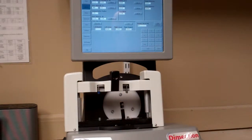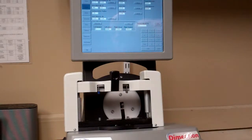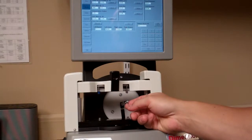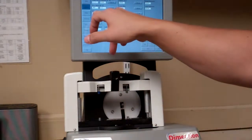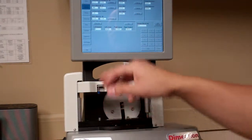The next item down is Extend Stylus Radius — you never change that number. It's set from the factory and is a measurement of the stylus. Unless a technician replaces the stylus and remeasures it, you never need to change that value.